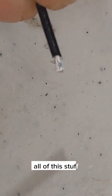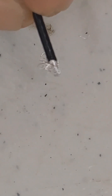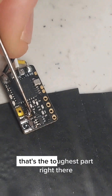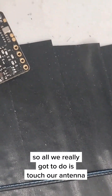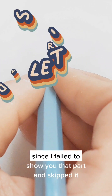Pull all of this together to two sides — it's extremely tedious. It should look something like this. That tiny blob of solder right there is going to be our connector — that's the toughest part, making that point without damaging anything else. All we really need to do is touch our antenna to that blob and it'll stick, then put our ground on one of these pads and it should work.